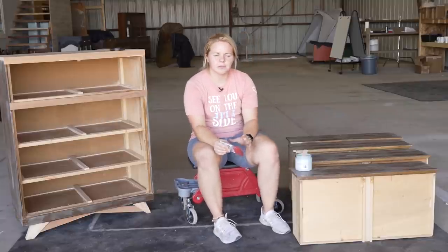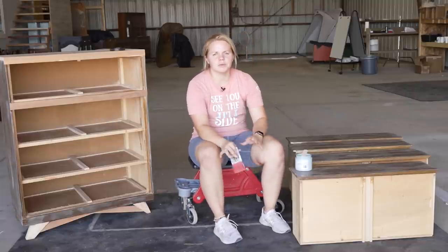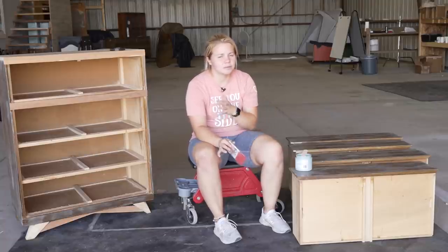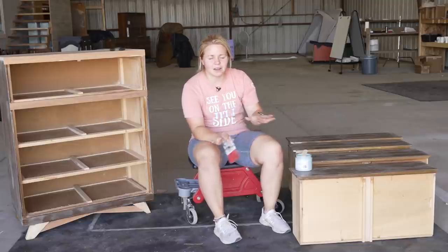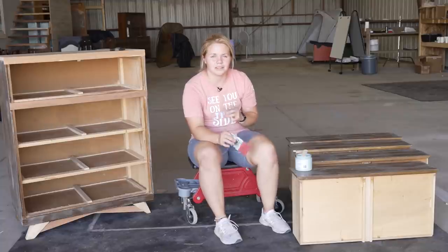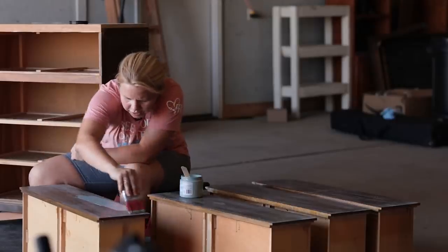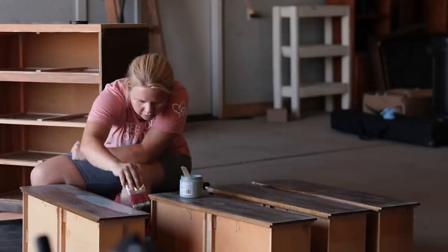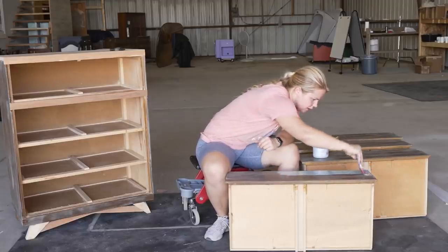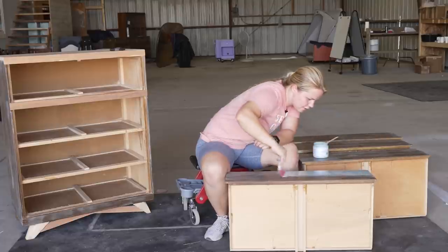With the silk paint, you wanna be really careful. You don't wanna overwork the paint because that's gonna cause brush strokes. Otherwise, if you don't overwork it, then it's awesome paint and it self-levels on its own. So that's one really awesome quality of the silk paint. We don't need to water down the paint at all, because it's got all of the qualities it needs in it already, and it's not even very thick.